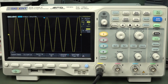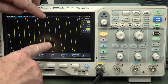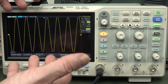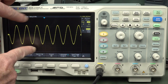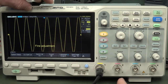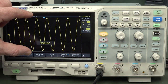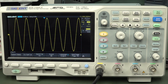In a previous video, we looked at the advantages of using the vernier control on your oscilloscope. When your signal is too big to display on screen, it's outside the ADC range of your front end and it can't do measurements. If you turn it down, you waste a lot of your analog-to-digital converter range. So you hit the vernier control — fine adjustment mode — and bring the waveform just within full-scale range, taking maximum advantage of all 8 bits, or 10 bits if you've got a fancy scope.